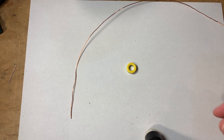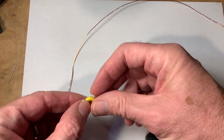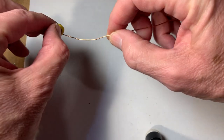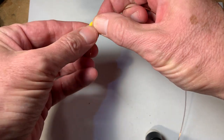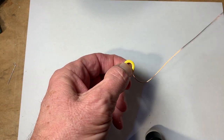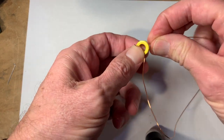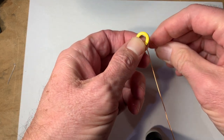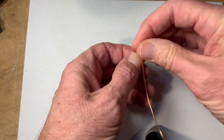The first thing I'm going to show you is how, physically, how I wind them — there's kind of a knack to it. Start out with a piece of wire. Every time the wire passes through the core, that counts as one turn. So I start with the first one like that — one. Do another one — two turns. And it's just like sewing, three turns.